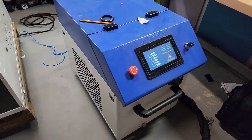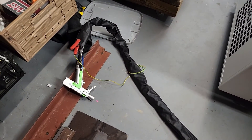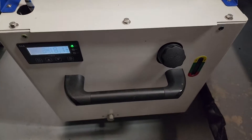You'll see an airline that you can run gas or just compressed air through, which runs up to the nozzle and turns on and off when the nozzle is activated. If we flip the main control panel up, we'll see the laser source — it is liquid cooled. And here are the framing lights that basically help you line up where you're going to clean.